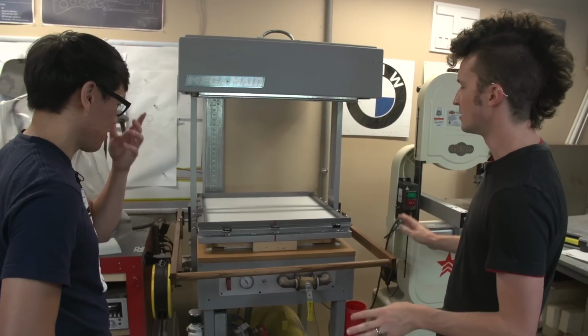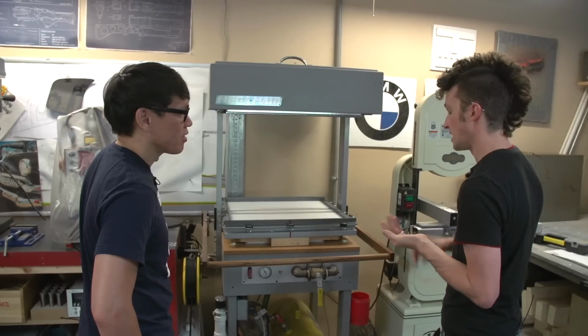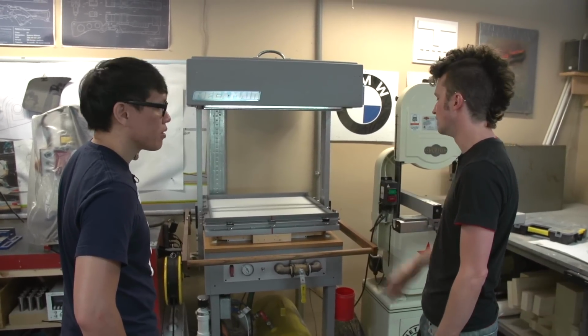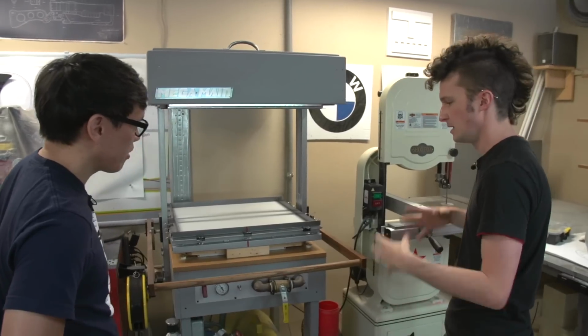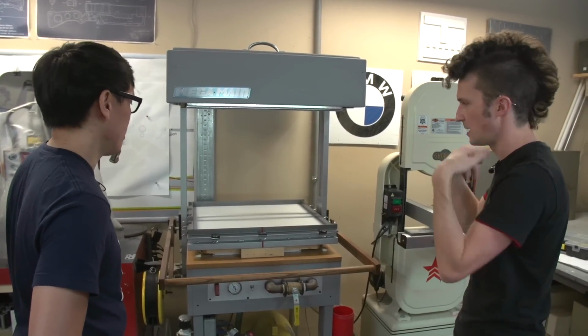And then I needed to pull really big stuff. So that's where Megamade came from. Megamade can do ABS, styrene, acrylic, and PET, whereas on all my other machines I could only do styrene. And I can do 24 by 24, my usable area about 21 inches of plastic. So I can make, you know, armor, and I'm gonna do a test pull for you guys here in a minute. Yeah. A masked piece that I did.